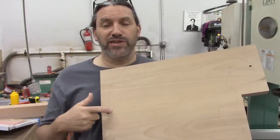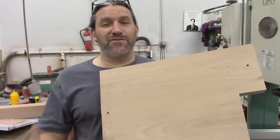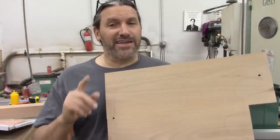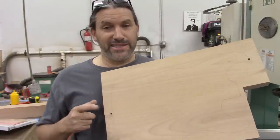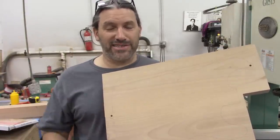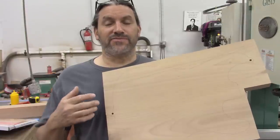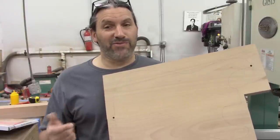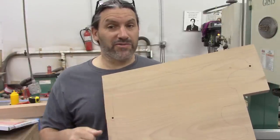We don't want to remove the off-body alignment pins until the very last second, okay? So that bears repeating. We don't want to remove the off-body alignment pin holes until the very last possible time. So it is very likely that we'll go, oh crap, we forgot to do something. We have to slap the templates back on. If we still have these holes, happy meal for us.